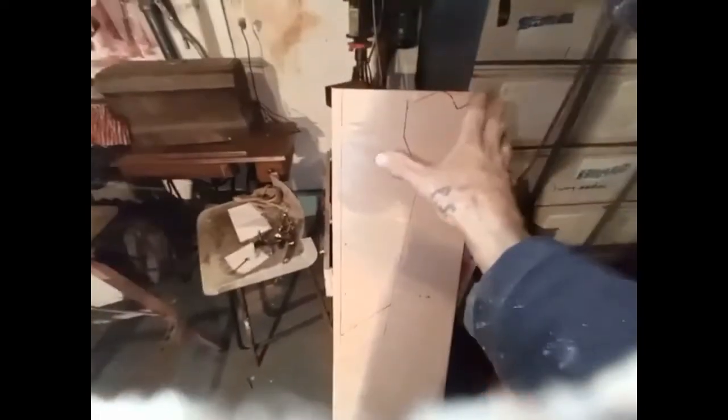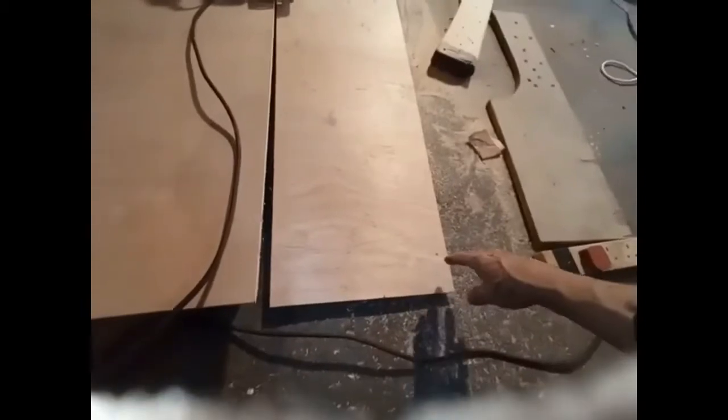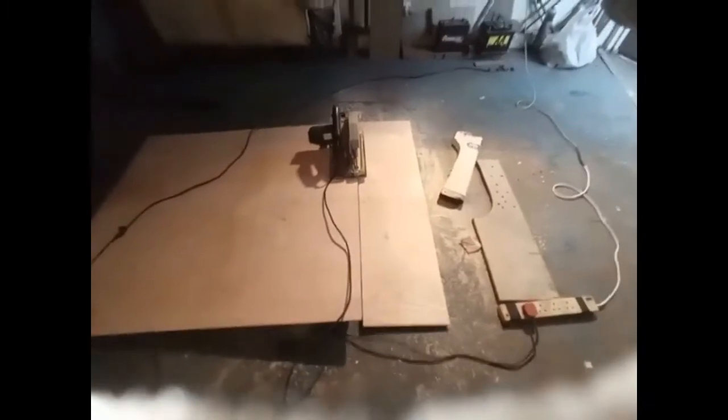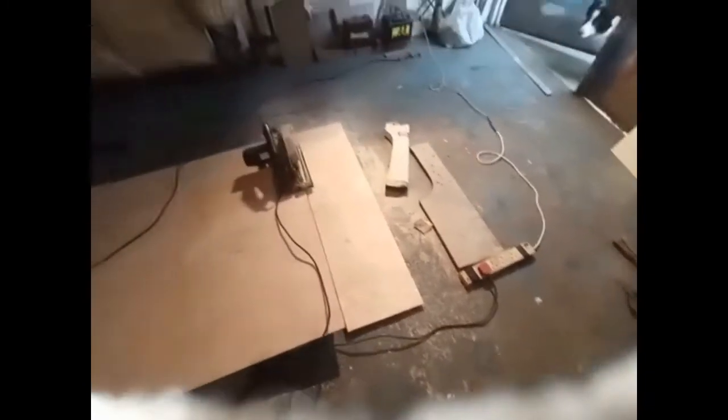Okay, I've worked out maybe 14 inches with the patterns on there, which can be ordered. You don't have to be stuck to it, but there's the top for the tiller to go on. Anyway, I'm now cutting it all into 14 inch strips, and I've come to the conclusion by looking at photos with the rudder leaning up against the van, this is going to be about 4 inches too short. So I'm going to cut all these now, and then I'm going to cut that one back and lay it on top of the other one and splice one over. Do the same for the other side, and then put the 5 together so they're all spliced, that end bit. It's all going to be fiberglass and it'll be covered in, so I'll show you that as we go anyway.